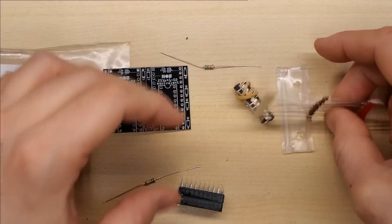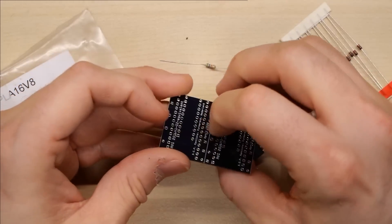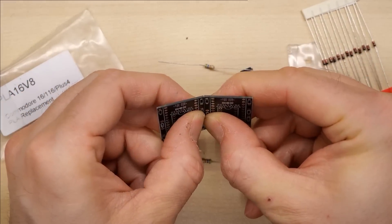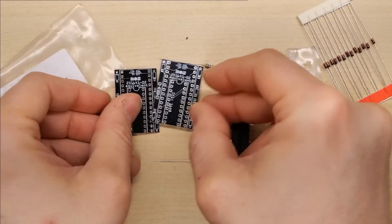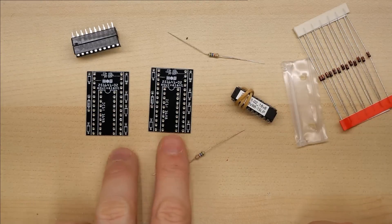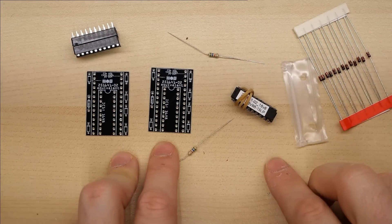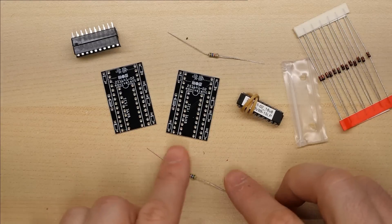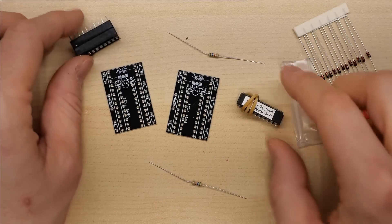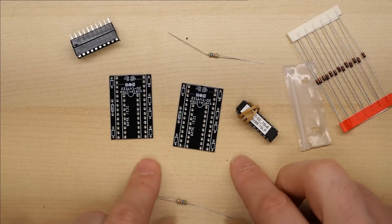I think this is a little bit simpler than the one for the 64. This is actually two kits joined together on a PCB, so let me try to break these apart. Two PCBs — so we have two kits for two machines, which is awesome. You'll notice only one GAL chip or PAL chip per PLA. That's different from the 64 one, which needs two. On the 64, the equations needed for all the logic are more complicated and take up more space than one of these ICs can handle. But on this series of machines, it's simpler, so one 16V8 is all you need.